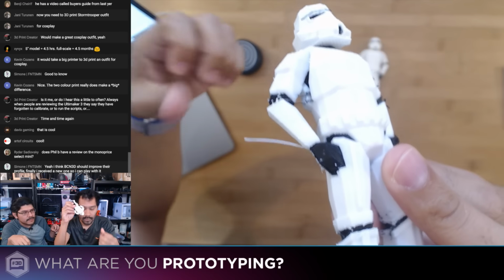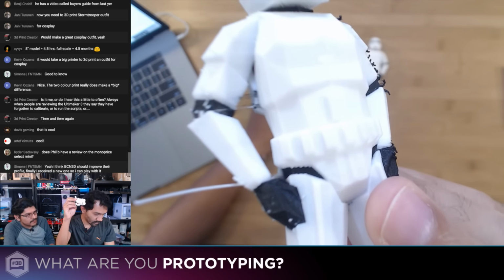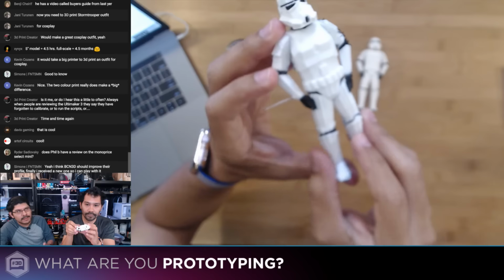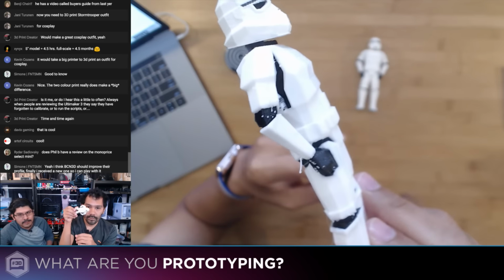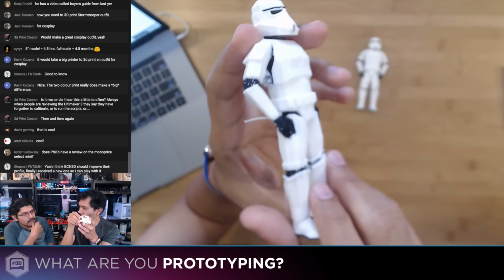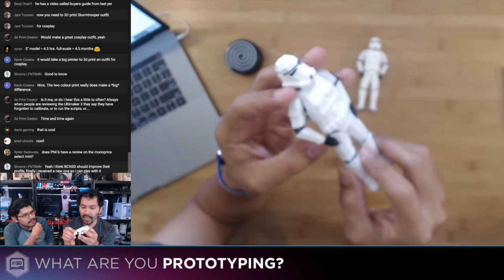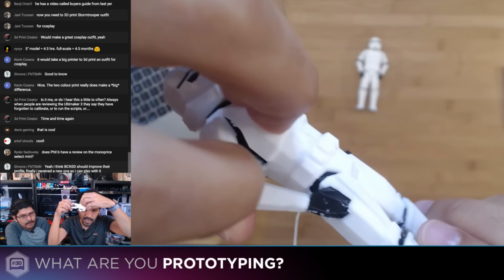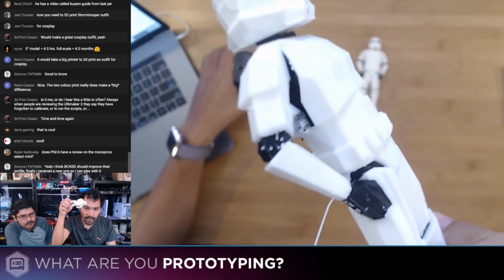The extruders are independent from each other, and it did purge after every tool change, so there is waste. Even with waste and with it being independent, it still managed to contaminate itself. Well, what's going on here? I do have that comb model feature, where it tries to stay away from the model so it won't contaminate it. Even with that turned on, it still contaminated a little bit. On this model, a lot, but we have seen it turn out really good, clean dual extrusion.